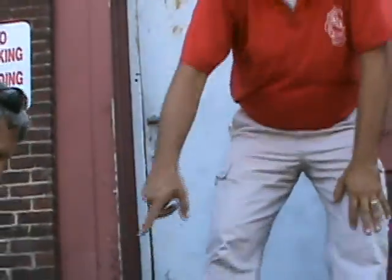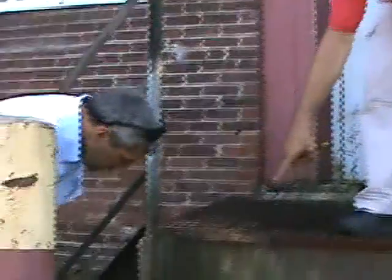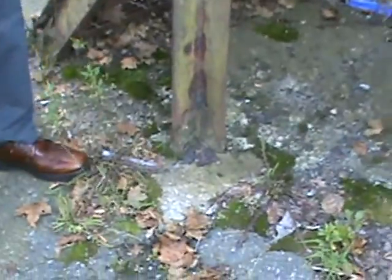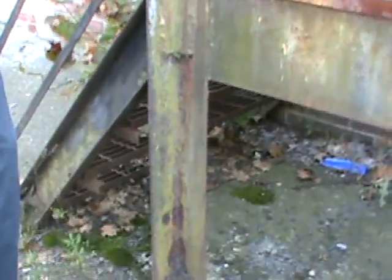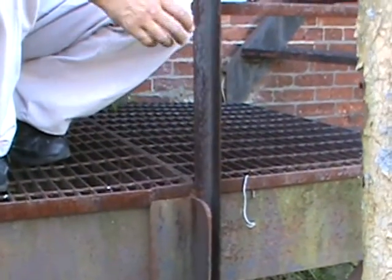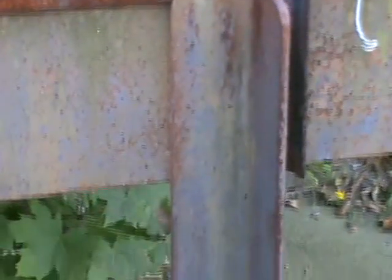Yeah. It's missing its rail here, and a lot of times this is a chain rail. That's right. Usually, if any kids get over here playing around, they could fall. So it's usually missing a passing rail. Look at the supports into the ground, how they're rotting, because it's just cemented into the ground as opposed to sitting on a pillar. That's another problem there. There are some welds here that I can't verify, but as soon as I put a bolt through here, I can verify this weld by putting a couple of bolts in here. So whenever you get welds, I basically nullify the weld by putting in bolts.